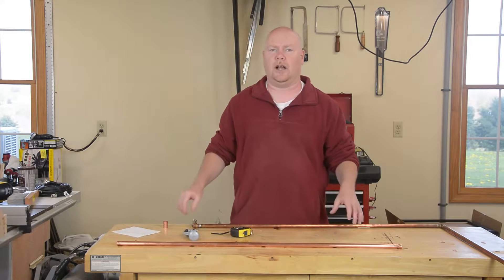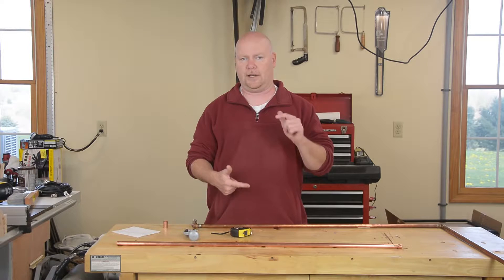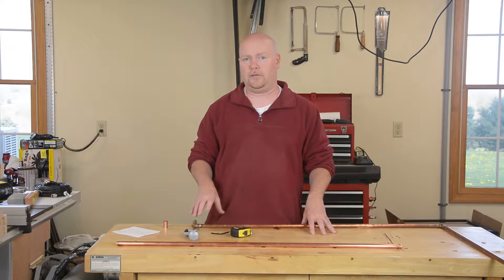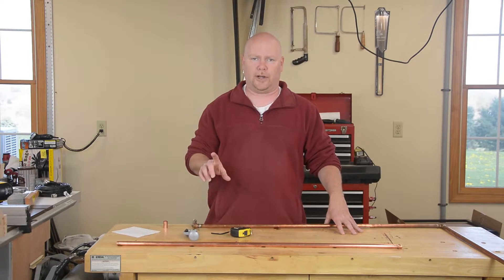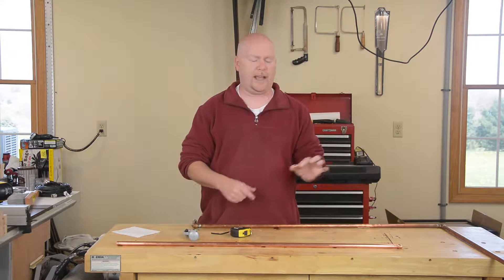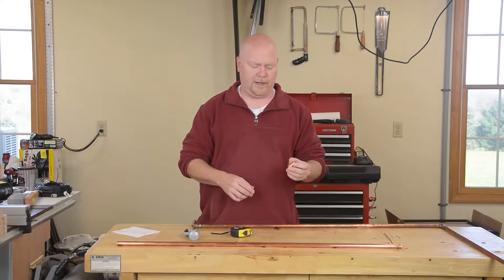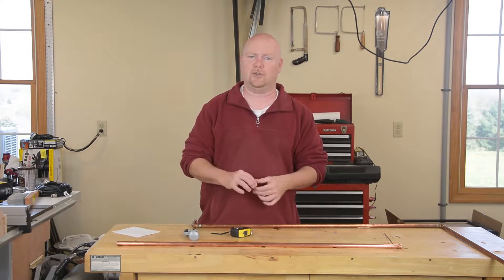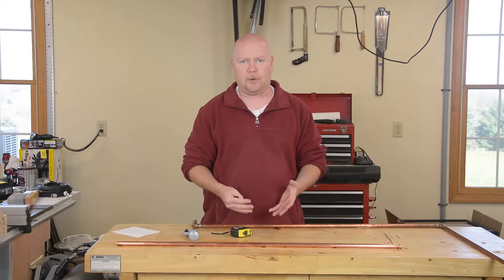I have lots of choices in this odd-shaped scrap to come up with the little bit less than 50 centimeters I need for the quarter-wave, but I don't have any pieces long enough to be the tall section by themselves. Not to worry — I have a coupler here, and as long as we take the length into consideration, the slightly larger diameter and a couple more solder joints isn't going to hurt a thing.